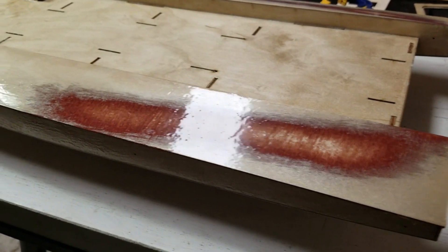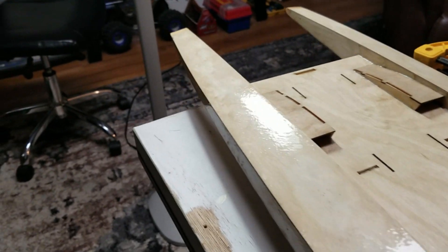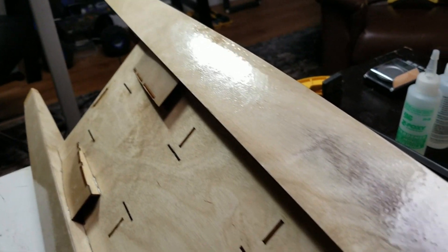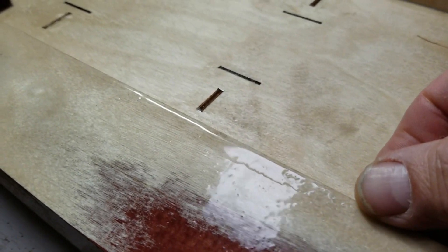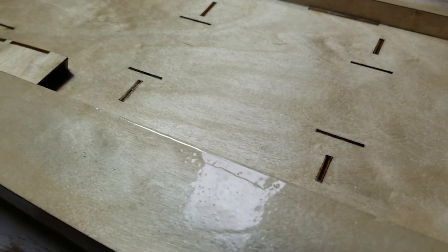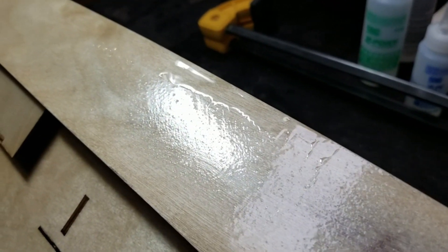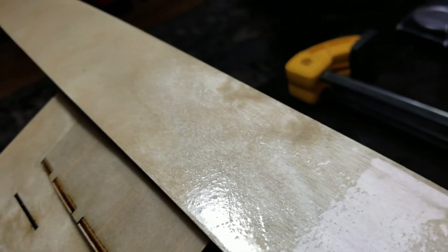The sanding marks are a great telltale. Here's a thin coat laid down — filled and flattened. Next, before I do the final sanding, I've built up this edge right here; I want sharp inside corners — that was a little low. I also did another mix where I needed a little bit on this edge here to level that out some too.